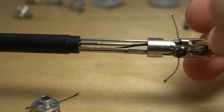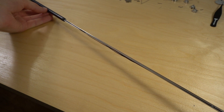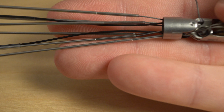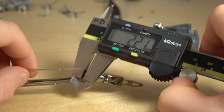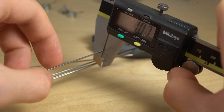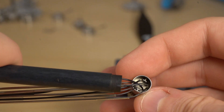Now we can pull it out. This was a surprise - I expected to just see cables in here, but it turns out there are solid steel rods going the entire length of the shaft. The cables are crimped at each end with just a bit of cable inside the tube, but the steel rods are quite a bit larger in diameter. The reason is presumably to increase the stiffness of the system - there's about 20 inches of length where if you can make it stiffer, why not? You can see it's about a little over 1 millimeter versus 0.45 millimeters. The end effector is held in place by the tension of the cables and keying features.